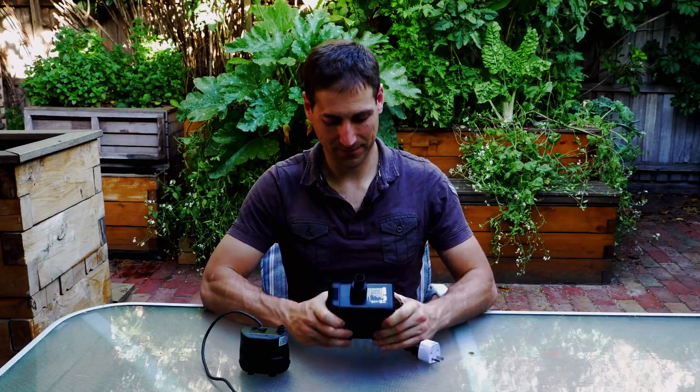There are some very big differences we can see here. This one is sucking water from the bottom, but this one is sucking water from the side, and you can see there is a large panel. That's really good because in aquaponics, one of the maintenance tasks is to check that the pump is still working correctly and is not clogged. Sometimes you have leaves or other things clogged on the pump. If you see that the outlet water flow is reducing, it means something is clogging the intake. If you don't clean the pump, it will start to use a lot of force and damage the equipment, so it's important to clean your pump quite regularly. The larger the suction area, the better it is.